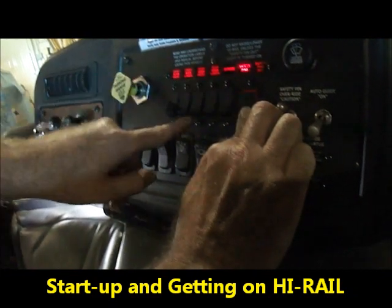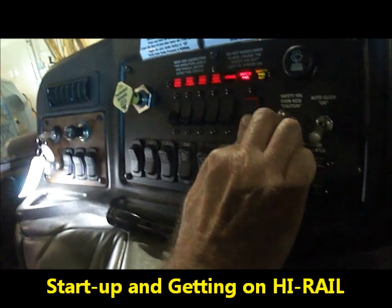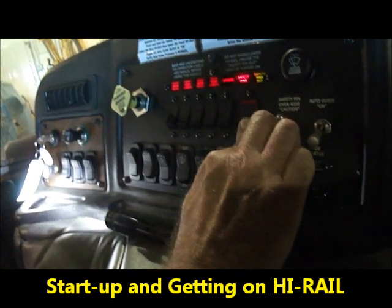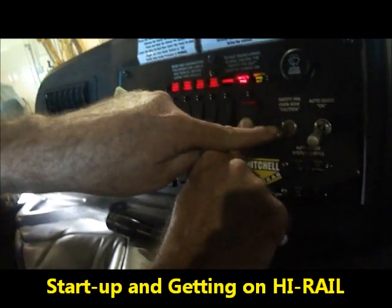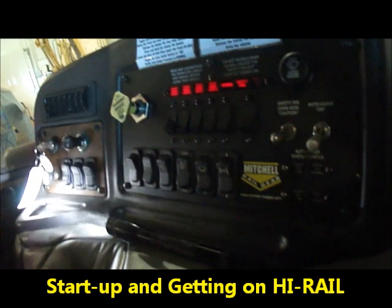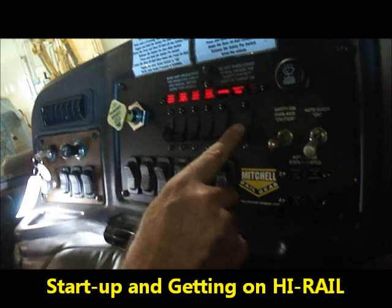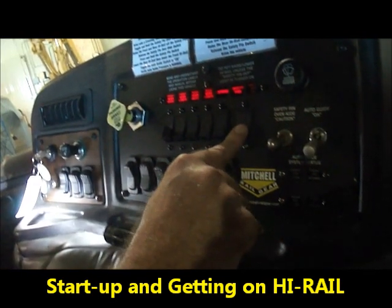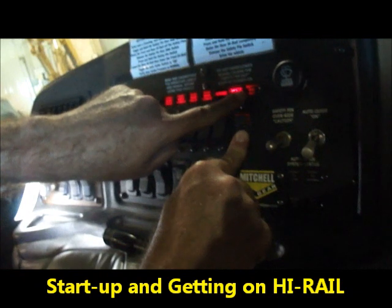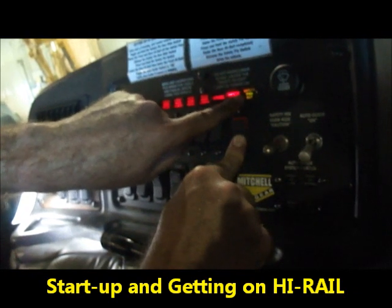Gear for the rear — raise. And our safety pin light came on green. If you do not see a green light, the pins are not retracted and it is not safe to move the gear. The safety pin light is still on with the gear raised. If I let go, the pin out light goes out. They are air-operated pins, so it will take a few seconds to re-engage them. Press the button and watch for the light to turn green. The light has turned green — all of my safety pins are safely retracted and it's okay to move the gear.